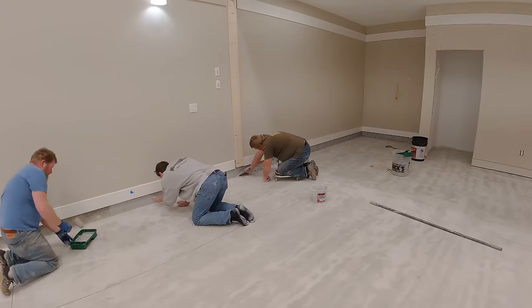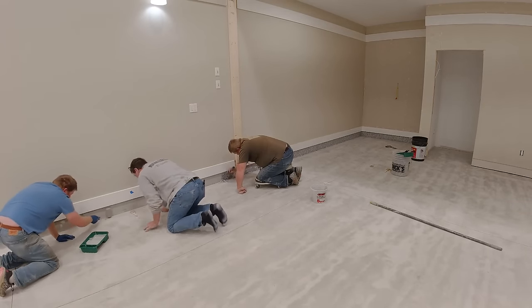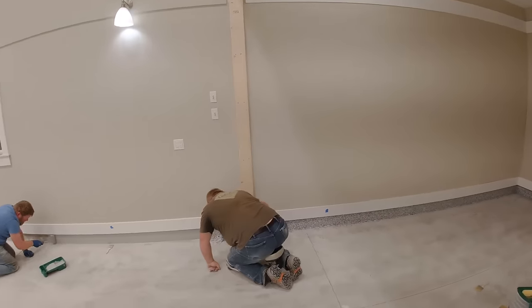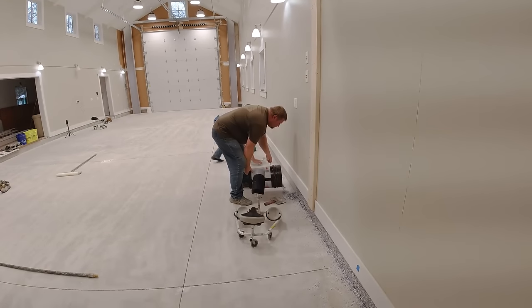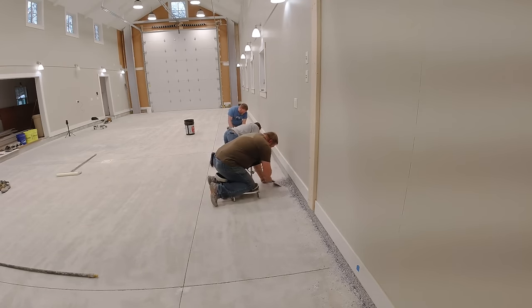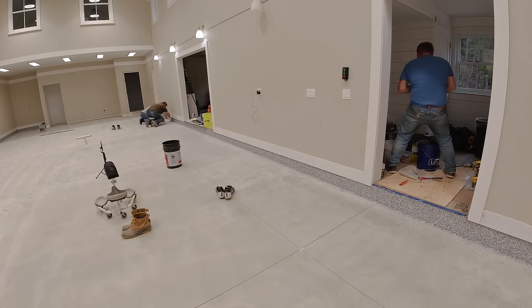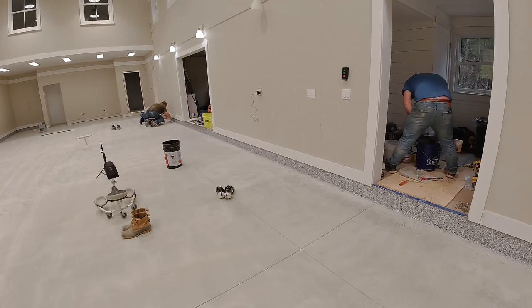The first reason is you don't properly evaluate your floor. What I mean by that is — let's say you bought a house, it might be 10, 15, 20 years old. How long ago was that floor done, and was there a vapor barrier put under that floor to keep moisture from coming from the sub-base up through the concrete? That moisture comes up as vapor and you can't see it. By the time it gets to the surface it usually evaporates, unless there's way too much of it. That vapor causes pressure when it's sealed off, so the moisture vapor will peel off, bubble off, or flake off a coating. If you don't truly understand that process, your coating is going to fail — and we see a ton of that.